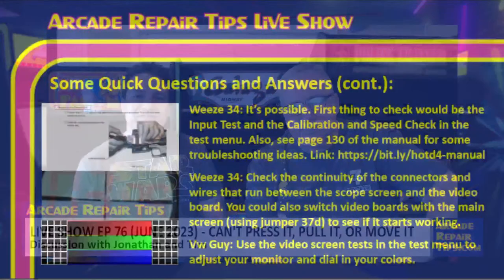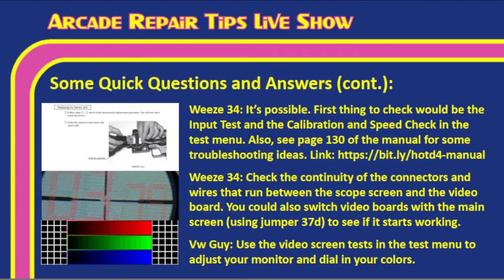Sounds good. So with all that said, guys, let's go ahead and review what Tim just said. Very first thing, Weez34, it's possible you do have a board issue with that House of the Dead 4 with the non-working guns. First thing to check would be the input test and calibration and speed check in the test menu. Also see page 130 of the manual for some troubleshooting ideas. Tim, we have a link to the manual here. Page 130 actually runs you through some things you can do if your guns are not working.